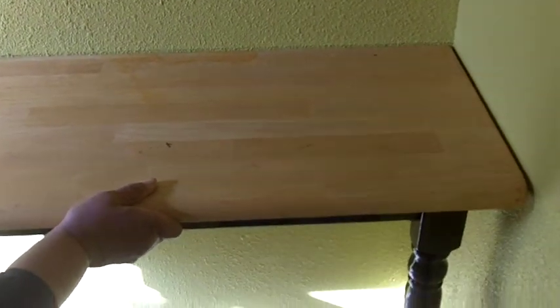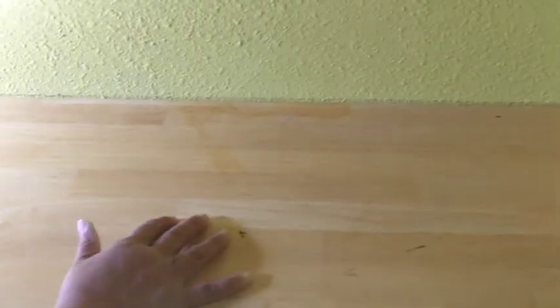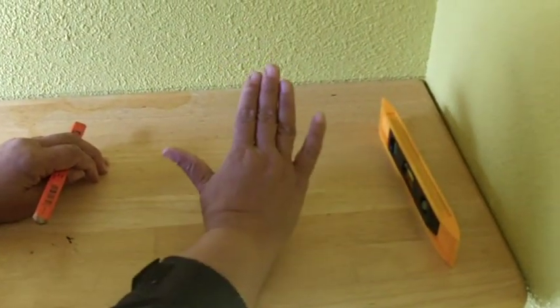What you want to do is lay the table against the wall. You want your legs solidly on the floor. Sometimes floors aren't level because of the material that's used — it might be a stone floor — so allow the table itself to find level. I'm talking about the back side of the table. Where does it matter where level is? It's going to matter right here, from the edge of your table to the back wall, because you don't want your table tipping forward and you don't want your table tipping in. So we have the table where we want it. Now I'm just going to strike a line across. Then I'm going to do the same thing with the underside of the table — strike a line with a pencil, starting in that corner, because it's going to tell me where I need to put my cleat. So I'm going to strike down and go across.